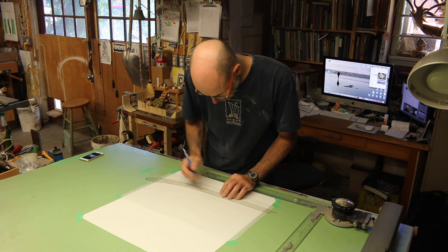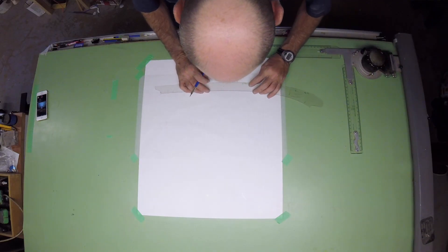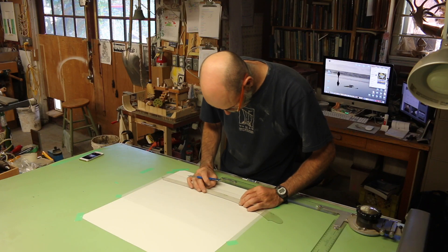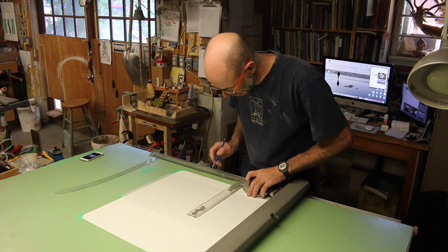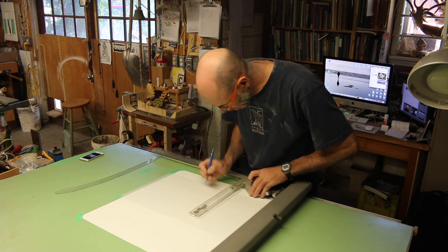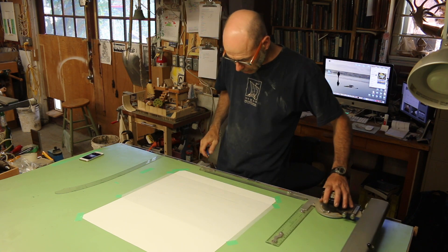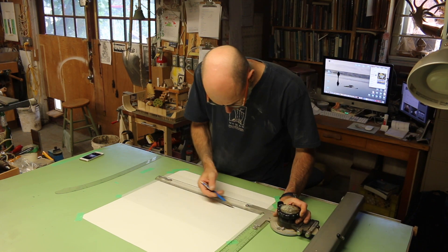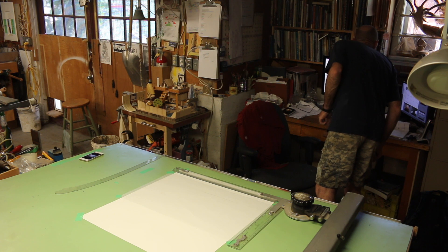What I'm about to use is called a ship sweep — it's basically a French curve but a lot longer and flatter. What I'm creating here is really what I would call an ideation drawing. I'm not too worried about all the little details; I'm just trying to get a general impression of what this boat might look like. Before starting I did look at a bunch of different reference materials — design books, pictures of dories, and the internet — and came down to a set of proportions that might work. I'm not copying anybody's specific design. I decided this 12-foot boat would be about 4 feet wide, with a bottom width of just over 2 feet and a length of just over 9 feet. I wanted the bottom a little wider but I could only go so far without losing the classic dory flared proportions.